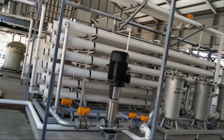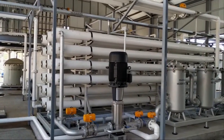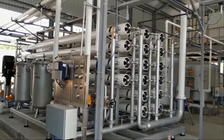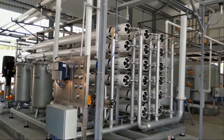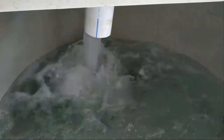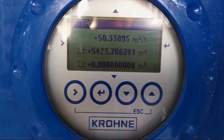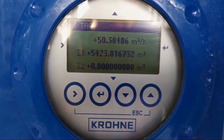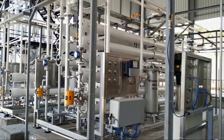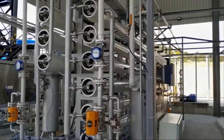The reject from RO stage 1 is then pumped to RO stage 2, in which 15% of the water is recovered. RO stage 3 and RO stage 4 are also installed for the maximum recovery of the water. The RO systems employ high pressure pumps and reverse osmosis membranes housed in pressure vessels. The automation controls with online monitoring instruments make these systems perfect. The reverse osmosis membranes reject the dissolved solids and produce pure water as the permeate. The multiple stage RO are equipped with clean-in-place cleaning systems.